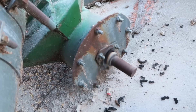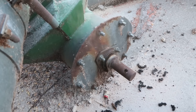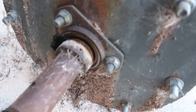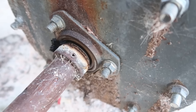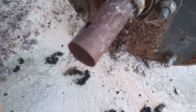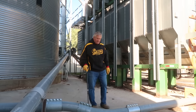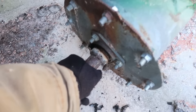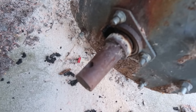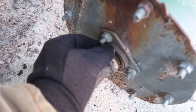I think they need to run it 10-15-20 minutes then get in and check the corn and make sure it's in good shape and not hot or anything. But it's almost on fire — we smelled this from over yonder. I don't know if this means we've got a bearing out. Yeah, we're melting the seal. I wonder if the bearing isn't out on the end of the auger here. It melted the seal, it was smoking pretty good — it's tight and I don't see metal coming out, but it wasn't the belts. It was coming from here.